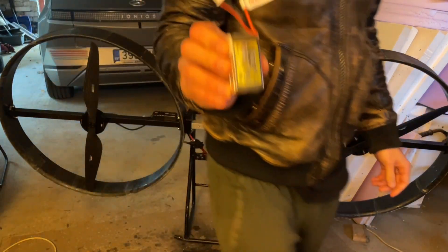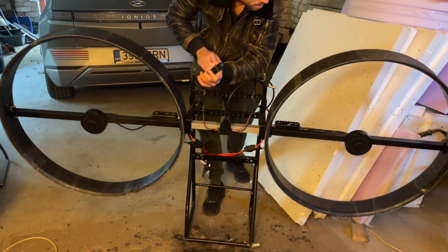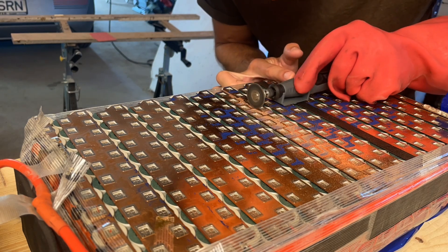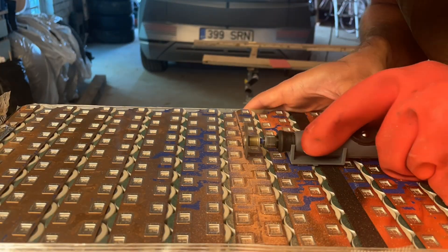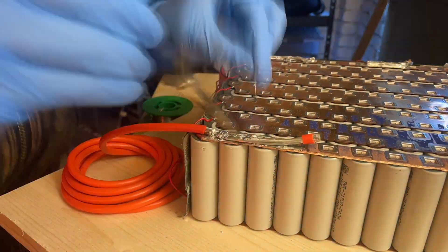After having done some testing with that little setup, it was time to juice things up and give the motors the power they need to get me airborne. I got a hefty 24S battery second hand and decided to cut the voltage in half — literally cutting the entire battery in half — soldering the terminal and balance wires on, ending up with two small 12S 11P batteries.